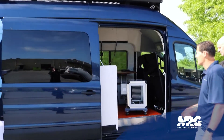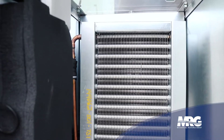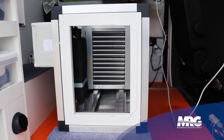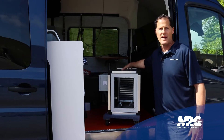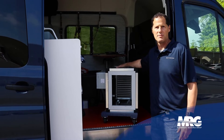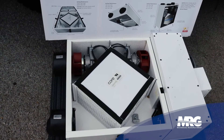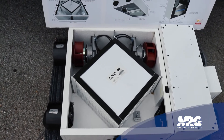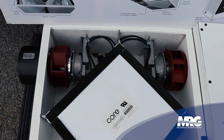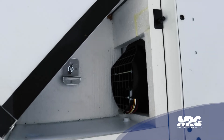We've got some residential products in here. This is a Daikin air handler kit — we've got a Daikin W controller, an electronic expansion valve that we factory-install, braze, and wire, so it's plug-and-play. Very easy to do selections for the coils as well. We standardize on coils and go through all the Daikin VRV requirements of pressures, volumes, and temperatures. The selection program will tell you what size EXV kit to order — it's a simple, quick process. We pre-commission the controls at the factory and put in the CFM airflow sequence of operations, so when your contractor installs it, there's not a lot of programming or field work to do. Very quick installation to get up and running.